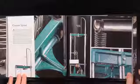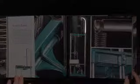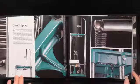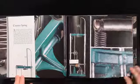This counter spring counterbalances the pull of the 20 smaller springs. The curved tapered post that holds up the spring can be moved up and down to adjust the tension. The summing lever has a limited range of travel and needs to be kept around its middle point. If the pull of the counterspring is too much, that is, the post is too high, then the summing bar will tip too far downward and get stuck. And if the post is too low, the summing lever will drop and will not be held up on its pivot. Once the height of the counterspring was set, we did not need to adjust it further.